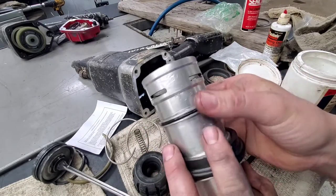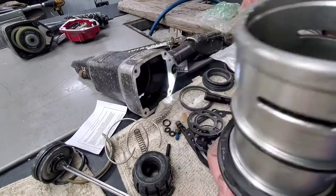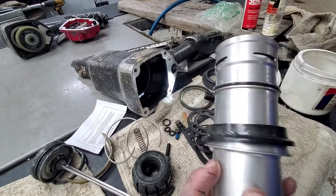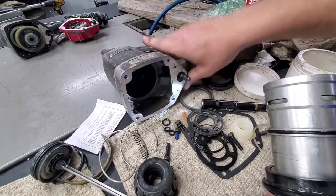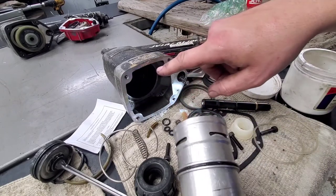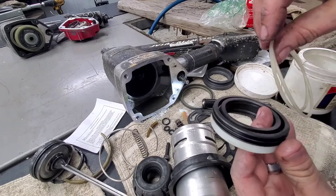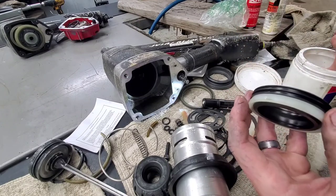It's looking good in there, so I'm gonna go ahead and throw just a little bit of oil on here on the outside. Again, that's for ease of installation later. When we put it back down in there, along here, it has less force, so it just kind of goes straight down in and grabs. Again, down in here, that's something we're gonna wanna clean out next. But first, while my hands are all nice and clean, I'm gonna wanna do the top of the head valve assembly also.